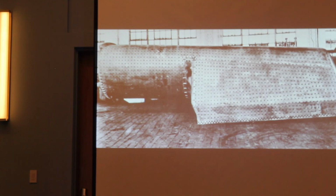So the tubes were good enough, because of good water treatment and care, that as long as they don't get corroded badly and pitted badly or a lot of scale on them, you can continue to keep it in service. Now that's really unusual, 27 extensions. I mean, 4 or 5 extensions is pretty good, but George is somehow able to keep them in service that way. But typically, 4 years back in the day was a maximum unless you had extensions, because they ran the heck out of these things back in the day.